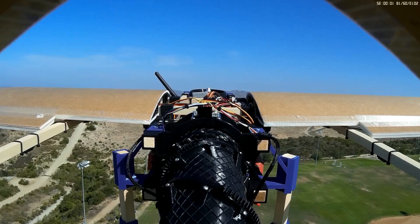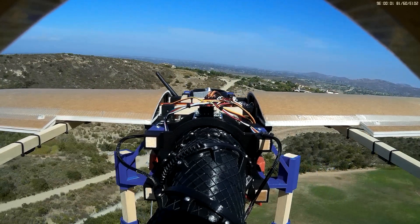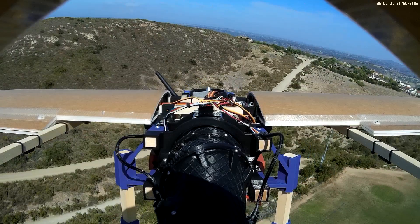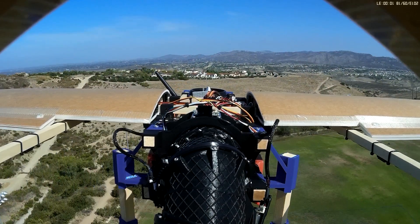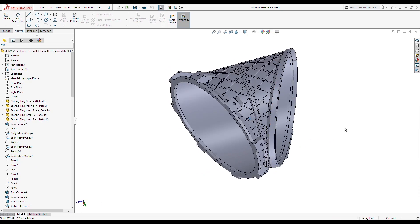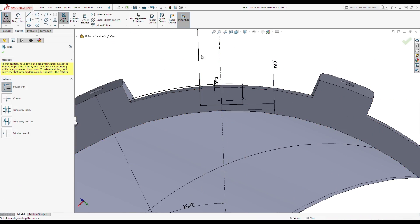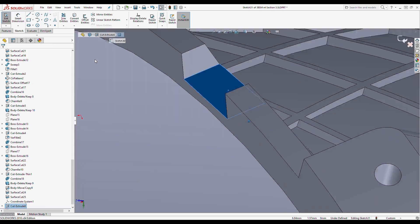You can see that section 2 is getting hung up, so the duct is becoming non-straight, and then a little after it kind of catches itself, stabilizes the aircraft, and I was able to land normally. What I decided to do to prevent this was to change the way the flanges interact with each other on the joint that was sticking.